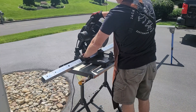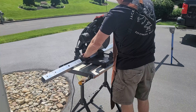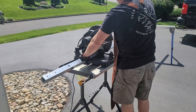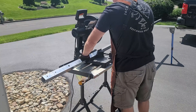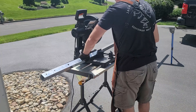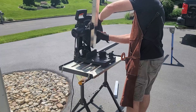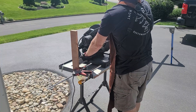The plans call for a really thin gauge tube for the x-axis, but my steel provider doesn't carry that thin of a gauge. So I went on Marketplace and found an aluminum tube — eighth inch wall — hoping it would work. The ideal is to keep the x-axis as light as possible so it doesn't bow down from the weight.